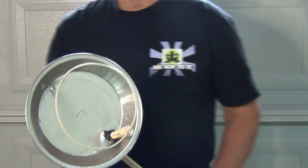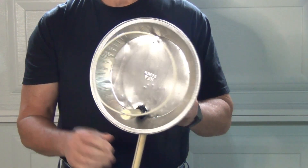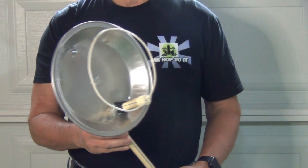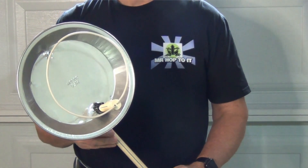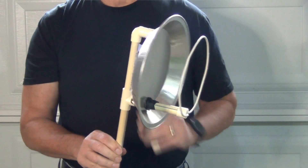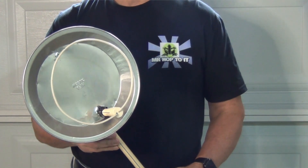The Pi-Pan with Reflector is an amazing antenna. Its reflector allows it to pull in stations over 70 miles away, and that's pretty impressive for such a small antenna. The drawback to any directional antenna is the reception field is much more focused, so this antenna isn't the best choice for receiving stations from multiple directions. It also has to be mounted out of the wind, so it's only suitable for attic or indoor use. Even so, if your station transmitters are located in the same direction and they are far away, this is a really good choice.